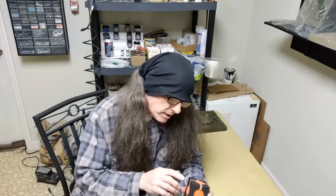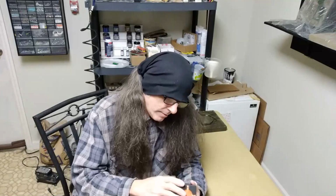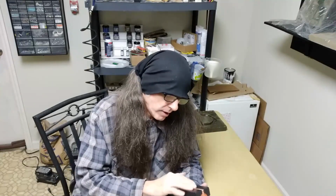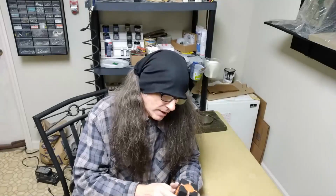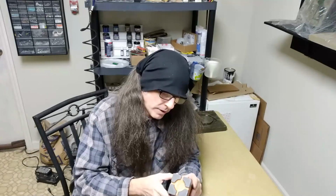Life. So I was going through getting the silicone off the corners, and I'm just scuffing up the orange epoxy, just because since I'm going to go ahead and pour another layer of epoxy and fill it up and then sand it back down, I want to make sure I get good adhesion. So anyway, I'll just show you real quick what it looks like when it's scuffed up.